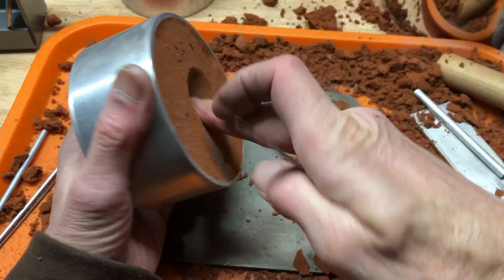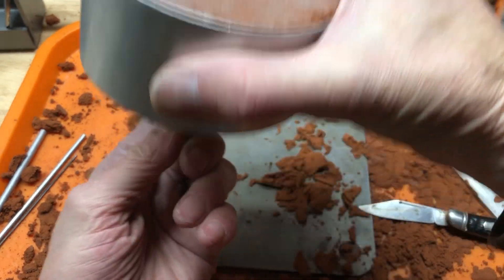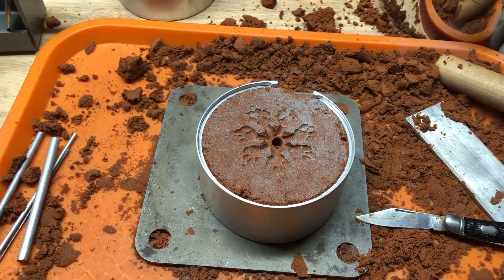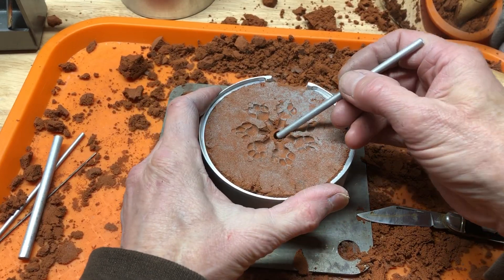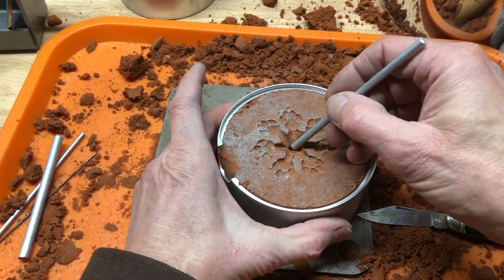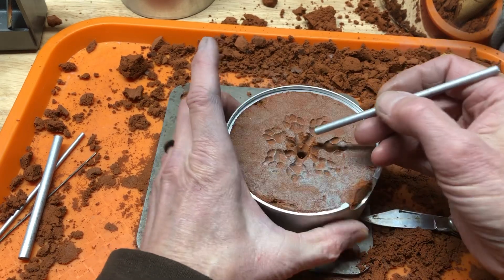You want this to be nice and smooth. Okay, we're going to go back over here, drop that back through, open it up on this side. We want to take an angled ease so that when the metal rushes in it just swoops down. What you don't want is for it to have to come down and make a sudden turn. If it kind of swoops in, you'll get less turbulence and a better cast.